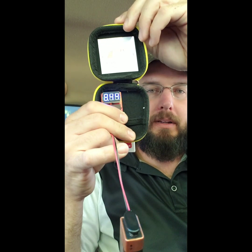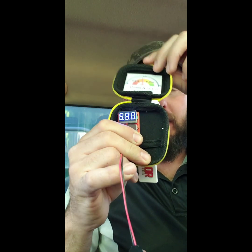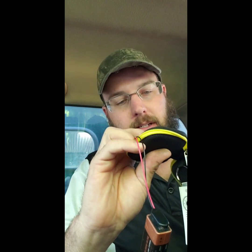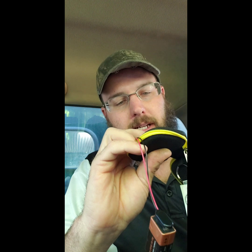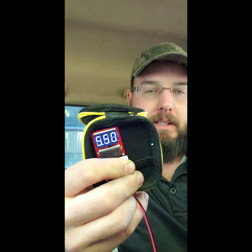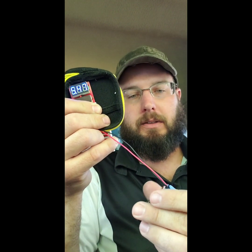All we gotta do is press the button. You can see we're down to about 5.7, and we hold this for three seconds — one, two, three — and we're getting about 5.50 volts. This battery is really not that good; it would not be an ideal battery to put into a safe lock. Now, if you give it the old tongue test, it still bites, so you would think it's still good, but it's not — it's nowhere near any good.